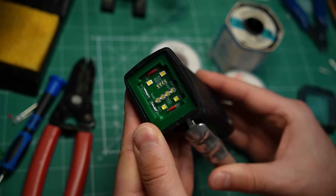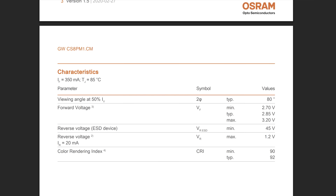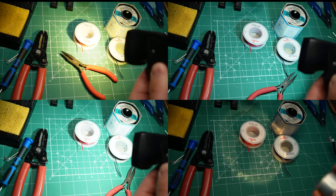And the more powerful Osram LEDs didn't work. For a while I couldn't figure out why, but then I double-checked the datasheet. Remember when I told you that LEDs cannot withstand high reverse voltages? Well these turned out to be particularly sensitive - their maximum reverse voltage is just 1.2V, so the AC from the dynamo destroys them instantly. That's unfortunate and unexpected because these LEDs are technically very good - they are very powerful and have a lower forward voltage, so they should be easy to drive. But that aside, all the other LEDs are much brighter than the original light bulb, just as you would expect.